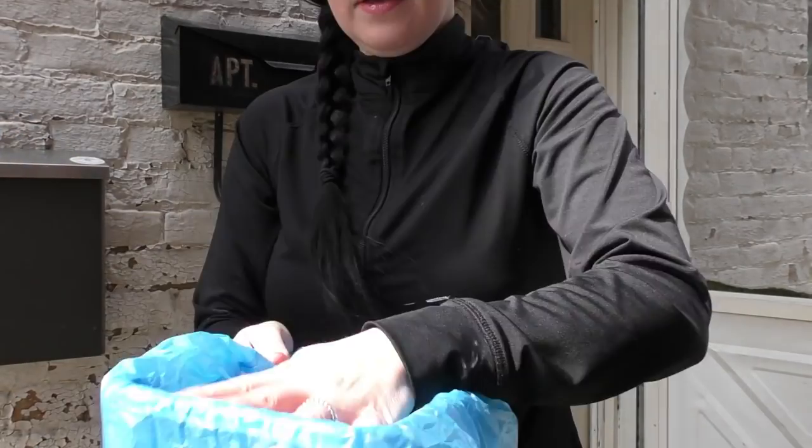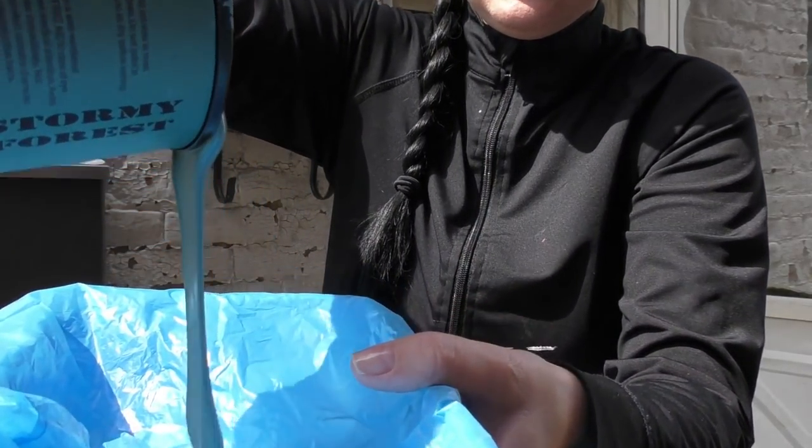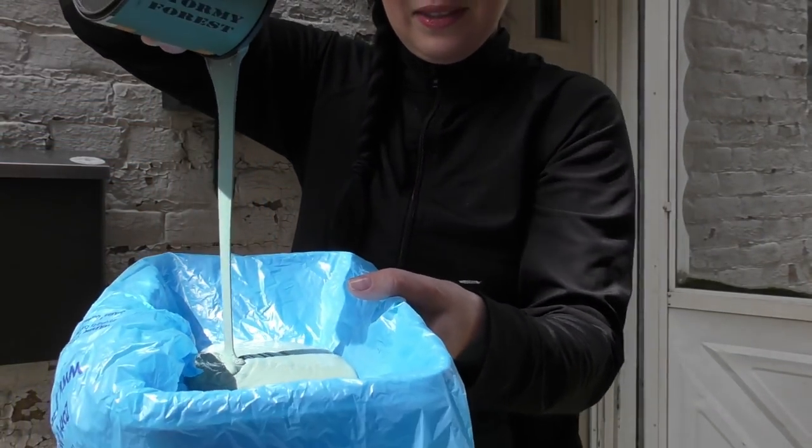Don't judge me — I'm a girl who likes to repurpose, do things on a budget, keep it simple. I'm gonna bag the Febreze tray so I can reuse it for the sealer. Pour your paint into your tray. I am using our chalky style paint, which sticks to pretty much anything under the sun, so I'm not gonna prime or sand or strip this door — I'm just going to get started. Quick tip: if your door is super shiny or glossy, take a sand pad and buff it all over to scratch it up so your paint has extra tooth to hang on to, which aids in durability.